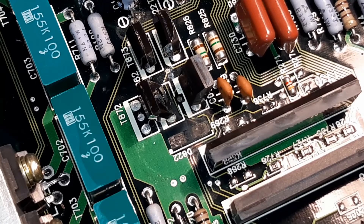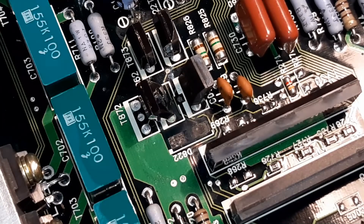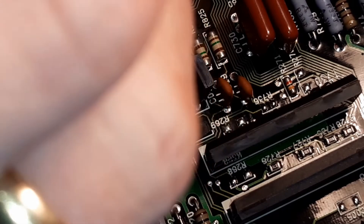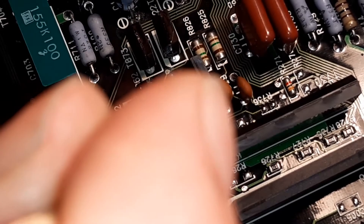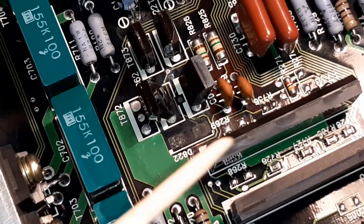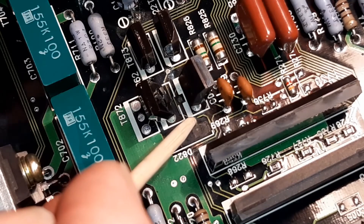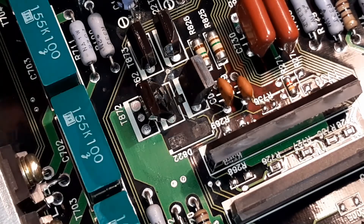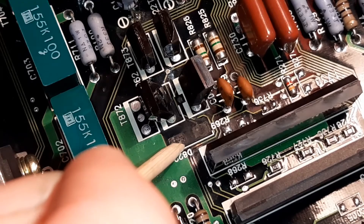Let's get that in focus. And exactly there is where the soldering pad should be — here and there. They're completely off, and I noticed in between those, I believe those are transistors, the lines that trace towards these pads also appear to be damaged. There's also a bit of green corrosion on this lead of that transistor over there. First, I'm going to try to measure continuity on these traces.